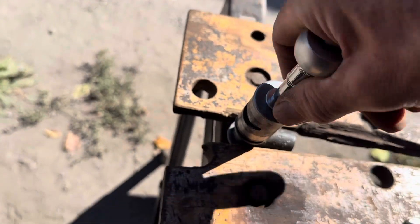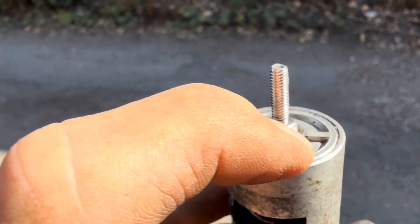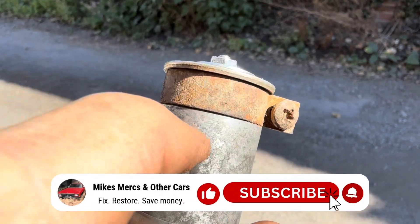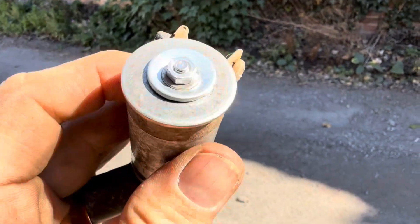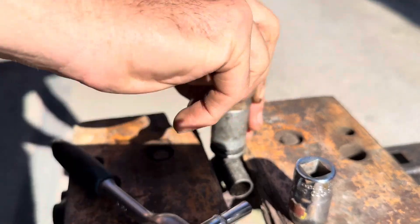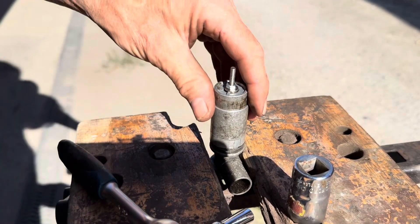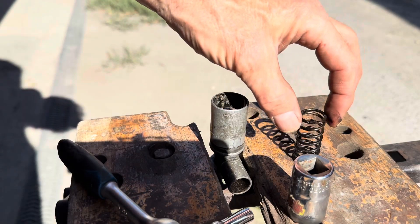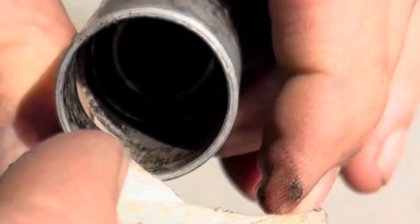Here it goes. Using this method, when we pull the piston out, we're only ever going to be able to get it flush because the washers will hit the edge. To get the piston all the way out, you can use a hose clamp that just sits on the outside of the housing but doesn't stop the piston coming out, and then tighten this up. That's it out. Now we just need to take out the spring and clean up the inside of this and we should be pretty much good to go.